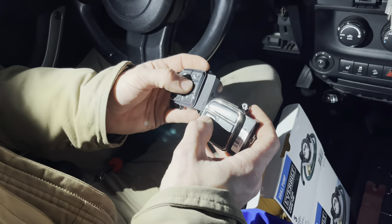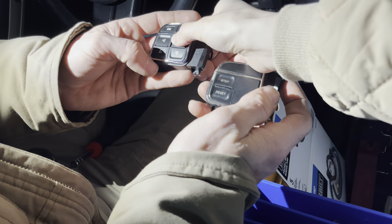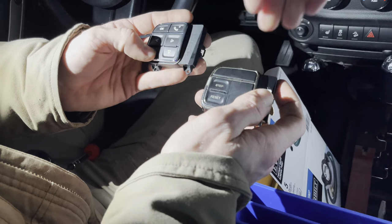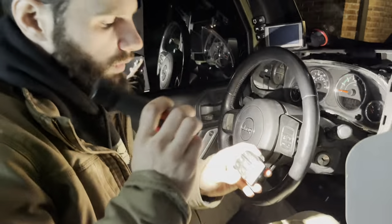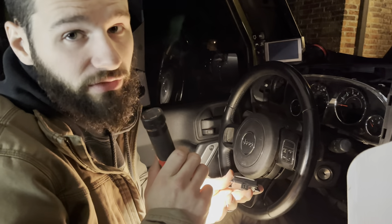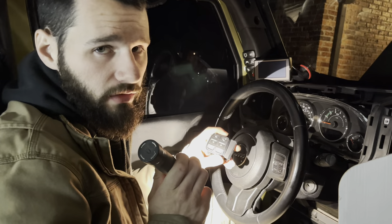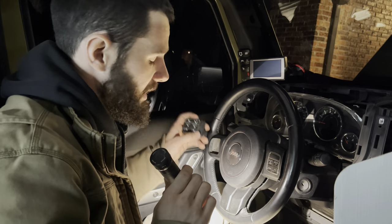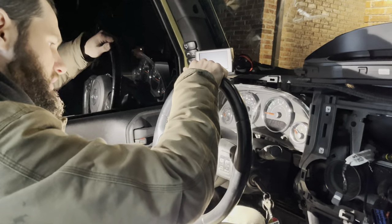The buttons feel just a little bit different. They feel new! The reason we are going ahead and installing this first is because she didn't even have the buttons, and you have to have the buttons in order to put your activation code in. A lot of people were confused about how to do that - well, this is how you do it. I'm going to plug this back in, reassemble the parts, and get the battery reconnected so we can have some heat.